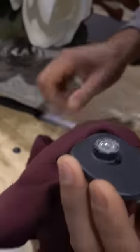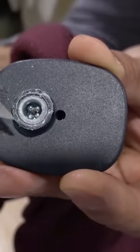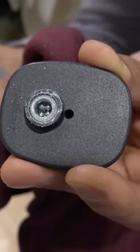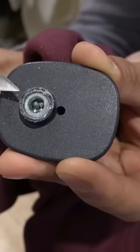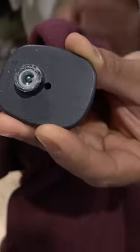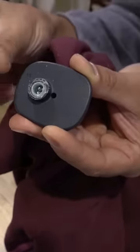And if we have a closer look inside now, you'll be able to see those ball bearings. So you can see there we've got four ball bearings. It's a pretty simple concept. What happens is basically the pin goes all the way through between those ball bearings. As you try and pull back on the pin, it actually gets wedged into those ball bearings because it's been held by a little spring.